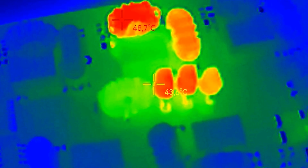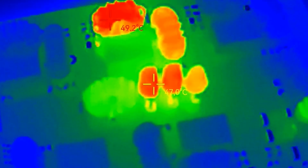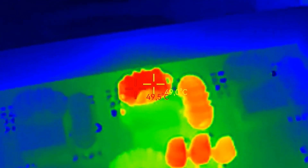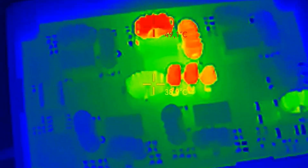I looked even with a small infrared camera to see some temperature numbers — looking awesome. The MOSFETs didn't even reach 50 degrees Celsius during a 10-minute long sine wave transmission.